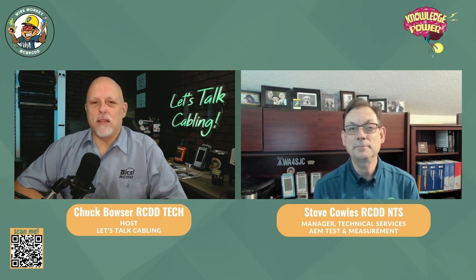So let's start off with the first question: why is it important to have your cable certifier calibrated regularly? There are a few reasons. Number one, any kind of delicate instrument can lose a little accuracy over time, especially with heavy use. Back in what I call the olden days — back in the 1990s when we were doing cable certification — those testers used mechanical relays. You might remember the testers going click, click, click.